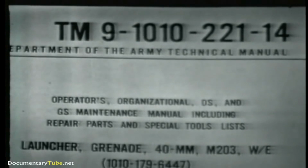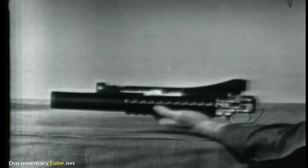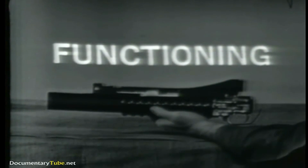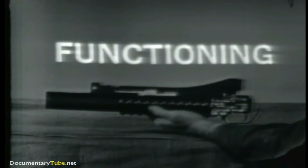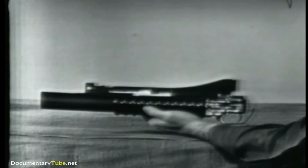When the barrel and barrel extension are moved forward, the top of the cocking lever is moved forward, causing the cocking lever to pivot on its mounting pin. The fork of the cocking lever is then moved rearward, thus moving the firing pin rearward. The firing pin spring is then compressed because it's positioned between the firing pin and the trigger. The firing pin shoulder is then engaged by the lower sear of the trigger. If the trigger is held squeezed, the upper sear will engage the top shoulder of the firing pin. When the trigger is released, the lower sear again engages the firing pin.